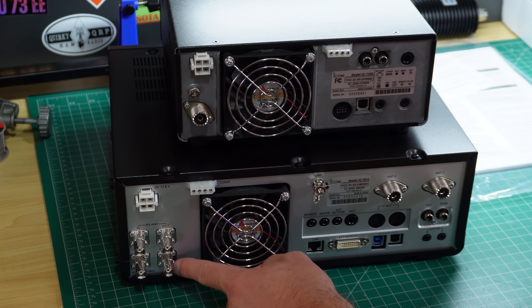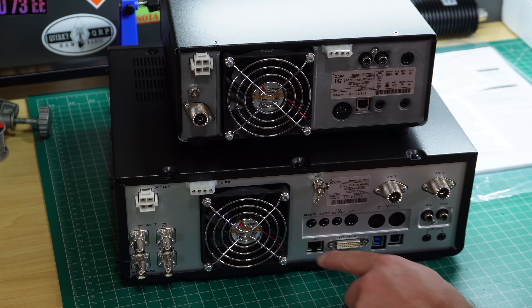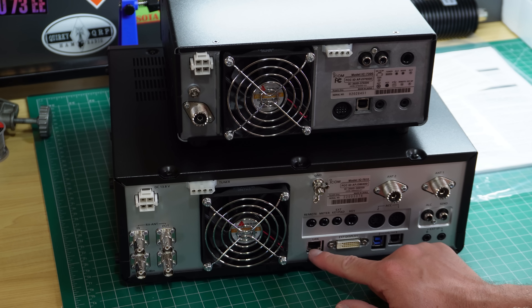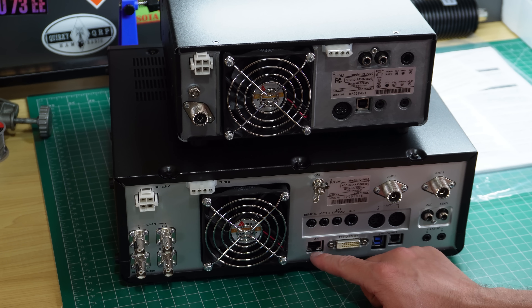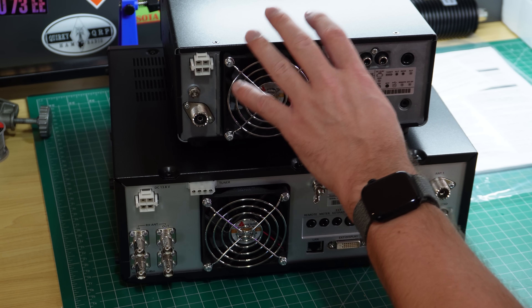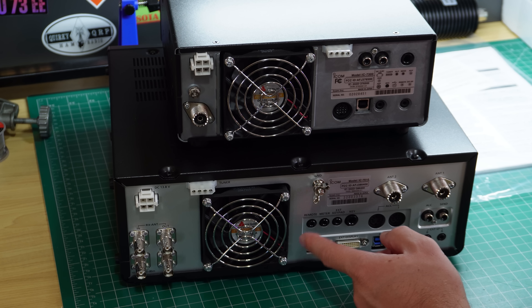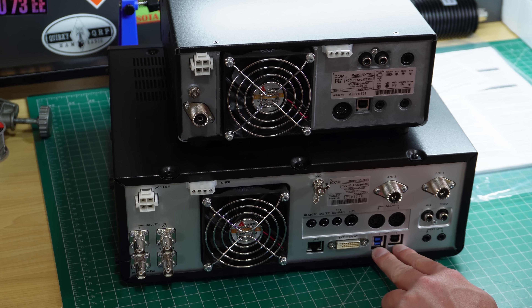You can even have another SDR receiver on that antenna. There's a reference input where you can GPS lock the radio to 10 MHz. There's also a transverter input — most of my transverters for microwave bands don't use HF or six meters as a drive, but if you do have one of those transverters you can definitely use that. The 7610 has a built-in LAN server, so you can remotely control this radio directly by plugging into the internet. You can use the ICOM RS-BA1 software, SDR Control app, Ham Radio Deluxe — all those things. With the 7300, you'd need a dedicated PC running a USB connection all the time, but the LAN port on the 7610 makes that a whole heap easier.